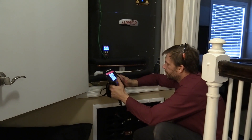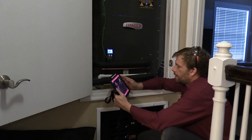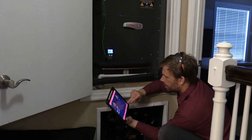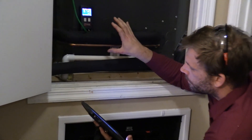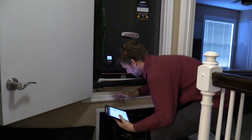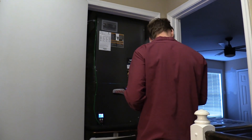I'm going to take measurement and save that. I've got my numbers here that I can check out, or I can go back to MeasureQuick and finish doing my report. Now my airflow CFM has actually been locked in to MeasureQuick, and I can get the rest of my readings. Let's go outside and make sure we're all hooked up.